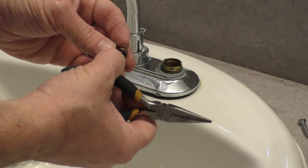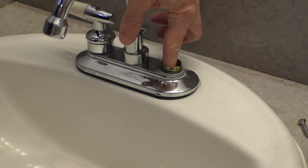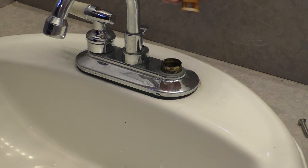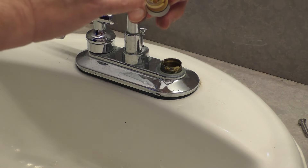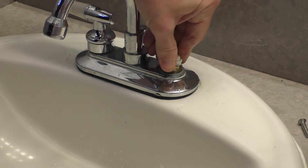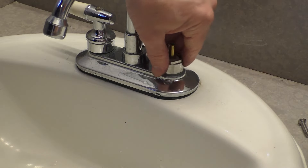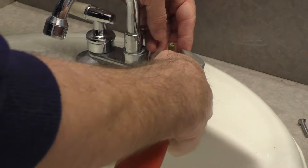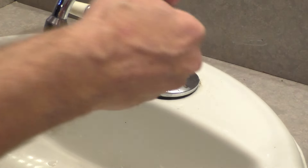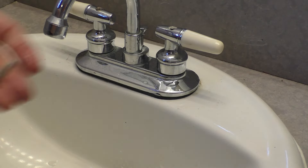Take the new seal, put the spring in, and fit it into the hole. Make sure it's moving up and down, that it's nice and springy, and that it's in the hole. Then go ahead and replace the cartridge — it came out this way, and if you put it in the wrong way, the holes will be oriented incorrectly, so make sure you put it back in the same way it came out. Then tighten up the little nut — not too tight, just so it holds in place. Put the handle back in and make sure it moves the way you want it to move. Then put in the top screw.